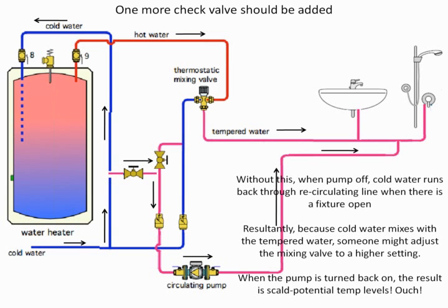The other problem you're going to run into if you choose to go to a thermostatic mixing valve that's a 1070, they really start to turn them up, because when you get into some of these situations, as I've showed, the water starts to trickle. So they're not getting any water out of it, and they think the valve is broken, the thermostatic mixing valve. Now you see why I prefer a 1017 valve at that location as opposed to a 1070 valve.